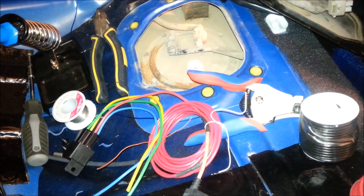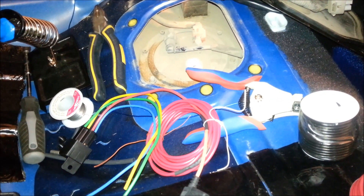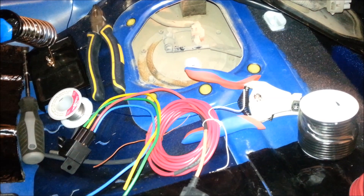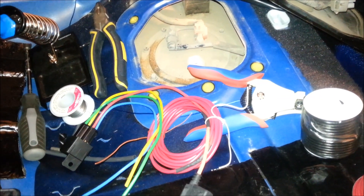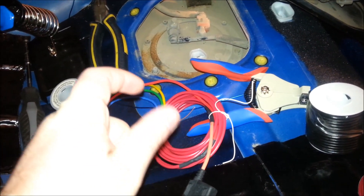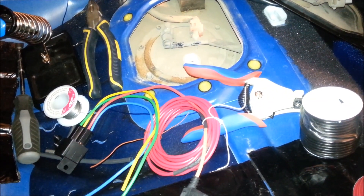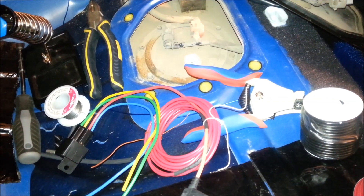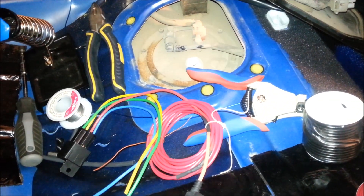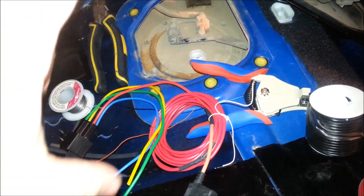I've just got extra wrapped up there, and I feel confident using that wire considering it's on a 100 amp breaker. The audio system only draws about 56 amps or so, and it only accepts an 8 gauge wire whereas I've got a 4 back there. So I actually have a distribution block to step it down from a 4 to an 8, and it's got 10 or 12 gauge ports on both sides for accessories. So for my pump, given the distances and the amperage, I've gone with a 12 gauge wire.